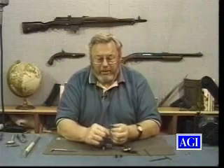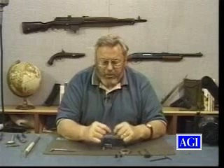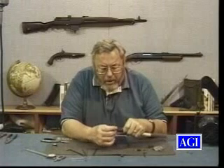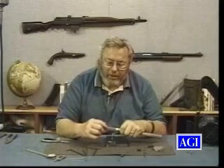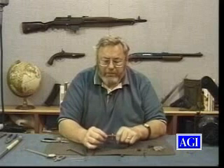The hammer spring on that gun looks a lot like this — in fact, it looks like that because this is the one that I made for one. And you determine that you'd like to make a stronger spring. Let's say it's a spring wire and the spring that's in the gun is 25 thousandths of an inch, but you want a stronger spring. Let's say we had a spring in a gun that was misfiring — it's a striker spring and it's misfiring. And I'm hurting for room, so I don't have a lot of choices for spring stock to put in a stronger striker spring. And it has to have quite a bit of motion, because the striker will have to move three quarters of an inch or something. So the spring has to be pretty flexible, but I want to get maximum amount of strength and I don't have a lot of room.